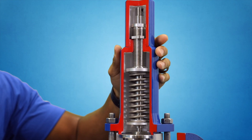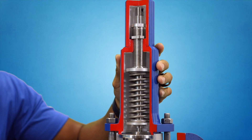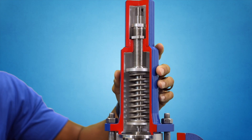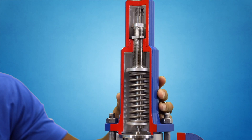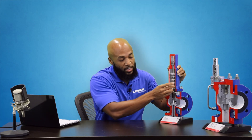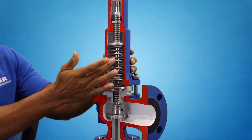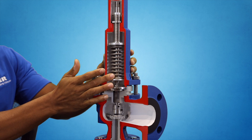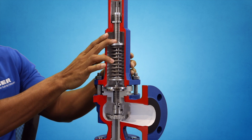This is the only way that a valve can be repaired or have its set pressure changed and retain its warranty. As the owner of this valve, you may change the set pressure yourself, but please be aware that you will effectively be voiding any warranty that a manufacturer will acknowledge. The second section is the bonnet, which houses the spring and the majority of the spindle — that spine running the length of the valve. This is where the compression that allows for adjustable pressure retention happens.